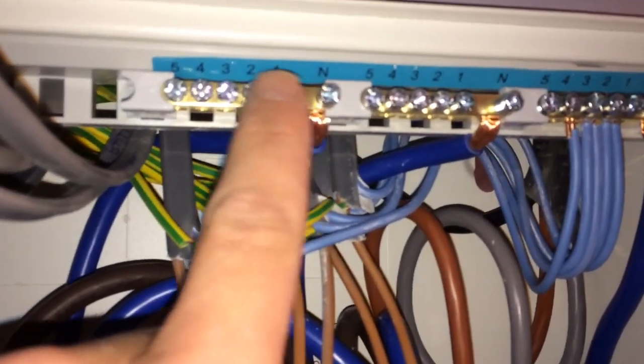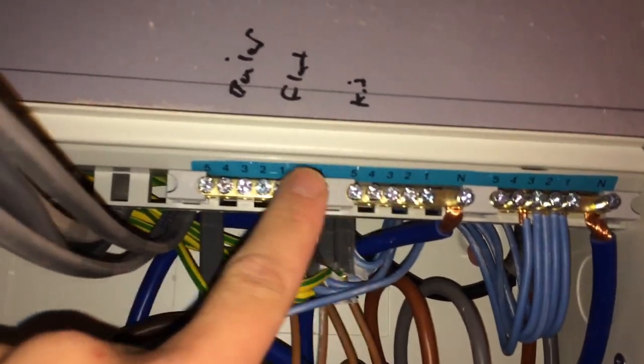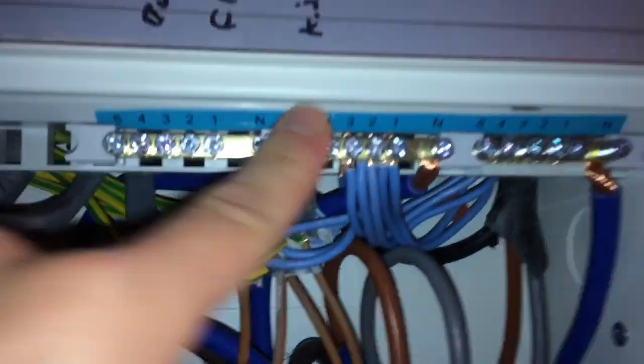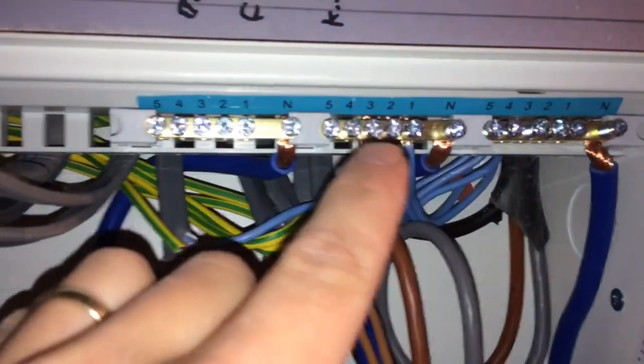I've just noticed I've read this wrong — these have got to go in there. This is the main neutrals, this is the first bar for the RCDs, and that's the second bar for the RCDs. The neutral comes in the top, goes through the switch — that's non-RCD protected. This one loops off and comes through the first RCD to the first bar. This one comes off the bottom and back to the second bar. You've now moved them to the right neutral bar. Also tip: don't cut cables straight along and tight — always leave a little bit for the next guy who needs to come in and do something.